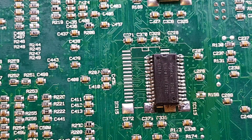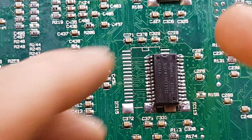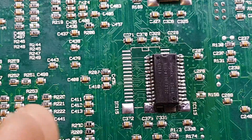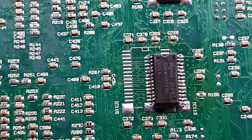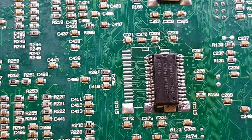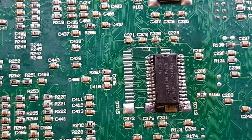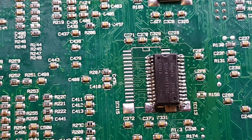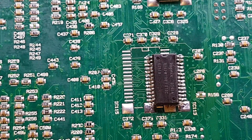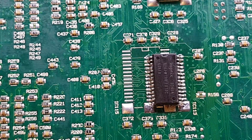It does take a little bit of time to get the technique. The majority of the time when I'm doing drag soldering I don't get shorts — you just need to get the feel for how much solder you need to use, and you will eventually get it. It'll just be straight along, straight along, job done — you don't need to go back and rework it. Hopefully you found that useful. If you did, please give me the thumbs up; if you didn't, give me the thumbs down. And if you haven't already and you'd like to, please subscribe. Until next time, guys — take care of yourselves. All the best.